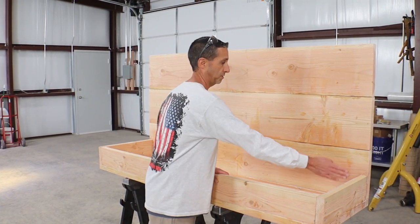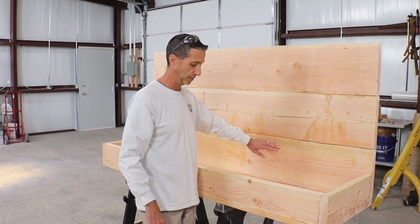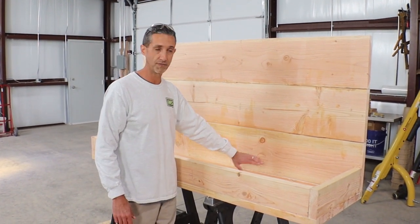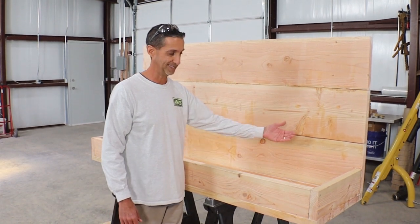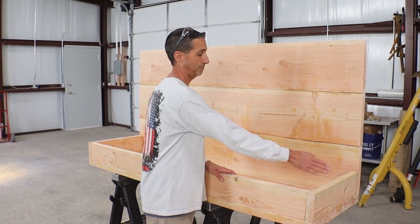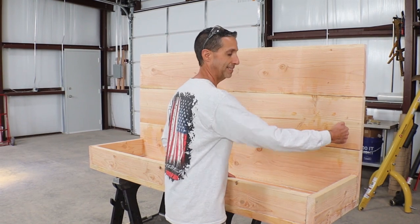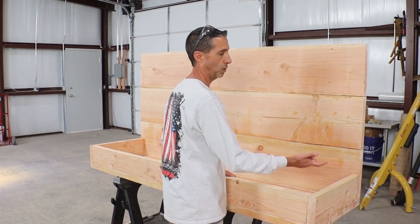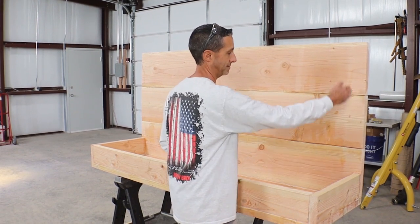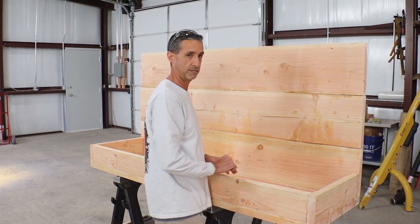We're also gonna be assembling our side panels here, which is where the feed chute is gonna be. And as part of that feed chute, I'm actually gonna be using the plywood that's down underneath our feet. So I'm also gonna assemble the base of that chute that's gonna be angled, that's gonna slide all of the feed forward and into the front part of this. Side panels, so you know that we're gonna be installing here, those are a 2x8. So we have 8 inches deep, and then of course the 2 inch wide, the standard sizing boards, all the way up here to the top. So you're gonna see essentially that side piece here on both sides, while I can still get in here and get everything sealed.